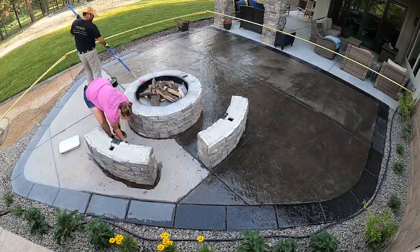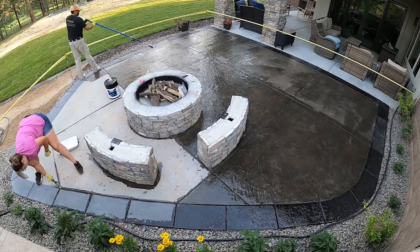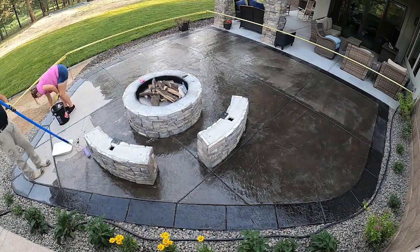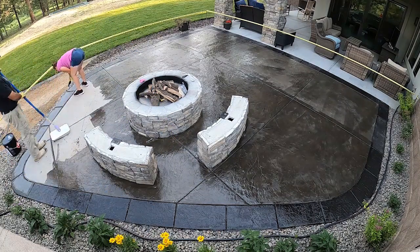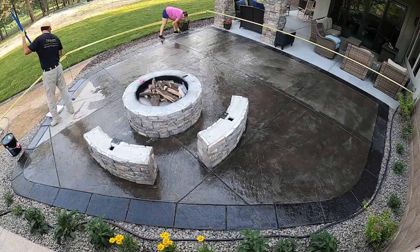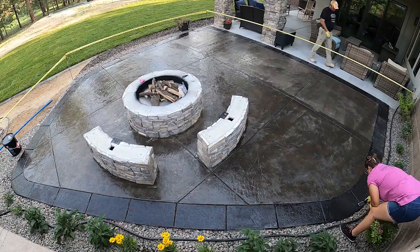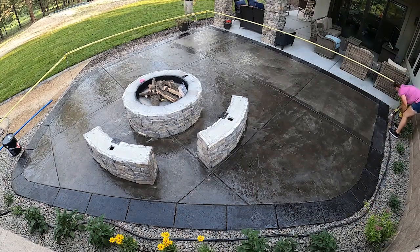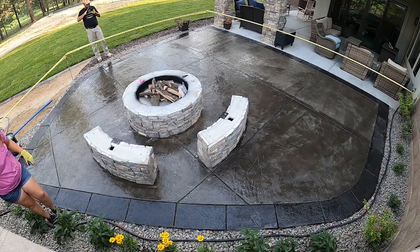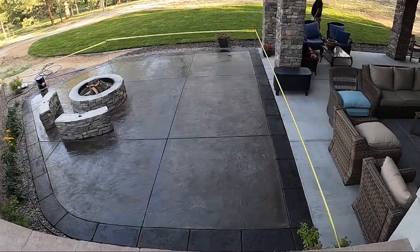You can see where I started. There's spots that are already absorbing really fast and drying up. That's that first coat. I've seen some people leave the first coat like that. I mean, it's okay, but if you want a little bit more of that gloss finish, it's usually good, at least with this product, to wait 2 hours. That's what the manufacturer recommends. We'll do about 2.5.